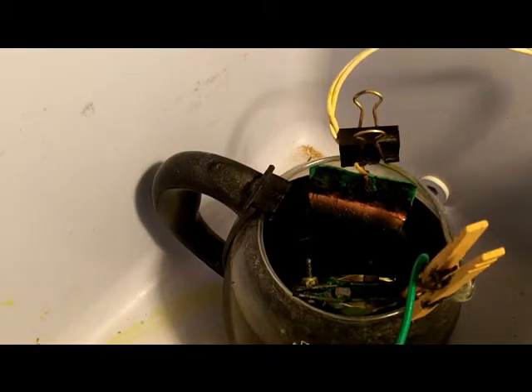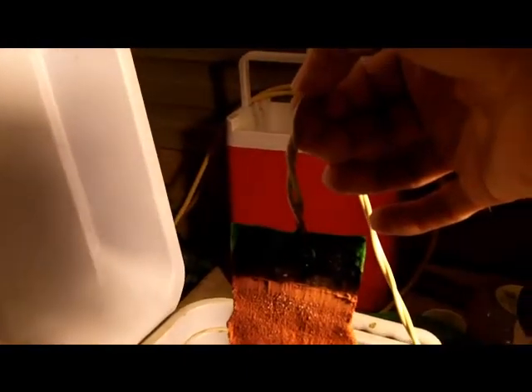There's corrosion almost everywhere already. That wire started to corrode already. I think the chlorine gas just took off the tin coating on that one, but didn't do it over here as much — kind of a weird corrosion pattern. The wires corroded probably from the chlorine gases being emitted. Here's the copper plate — it does look like we grew some copper, but it's rough.